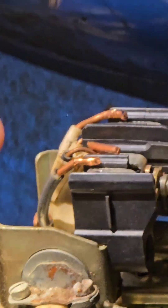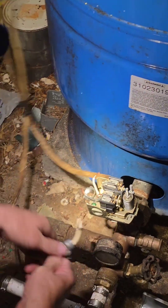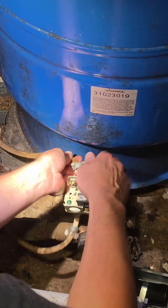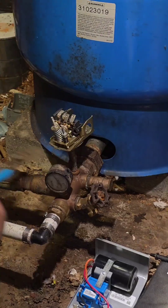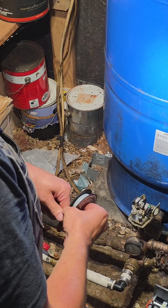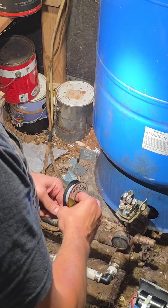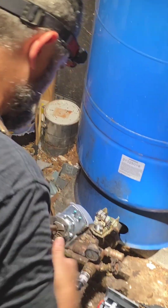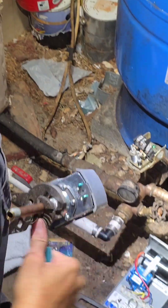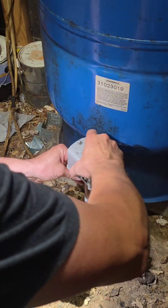Just unwired this the bad way. Pull the screws off, pull the wiring out. Sometimes it can be a little bugger with those lock nuts, but just pull it on out. Unthreading it here — I was lucky, it just came right out of the tank tee. Now the issue was clear: it was a galvanized nipple and it was completely corroded, so it wasn't reading the pressures correctly.